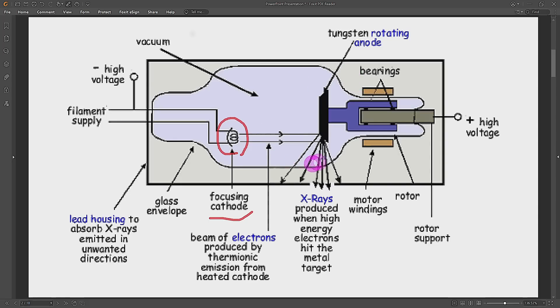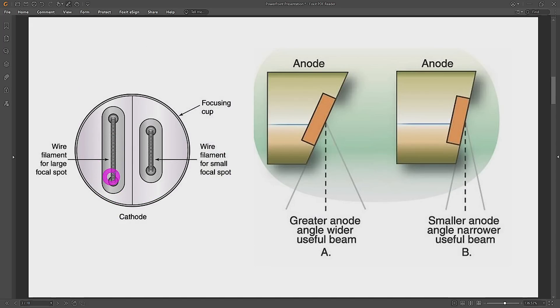The collision of electrons with the tungsten plate heats it up — that's one reason it's made of tungsten, for its very high melting temperature. Some tubes have rotors and a motor to spin the anode, continuously refreshing the area where electrons collide for cooling. You can also focus by using more than one filament: a big filament gives a wide aperture, a smaller one gives a more focused electron source. The angle of the anode can also be changed to adjust the cone of X-rays coming out.